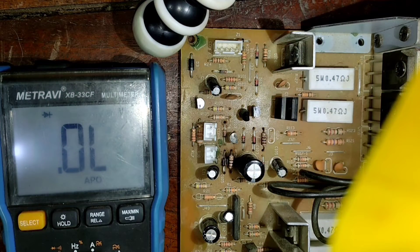I've replaced the two resistors, but it is still a very bad idea to connect everything back together. The neighboring components might have also failed, and we might not realize it visually. So I have to test the other components first and see if there are still problems.